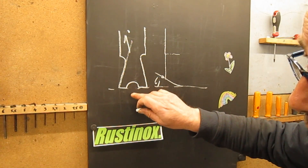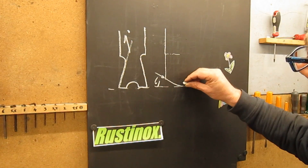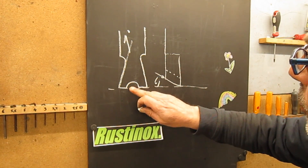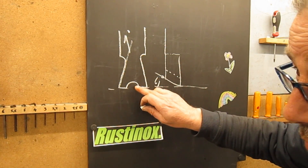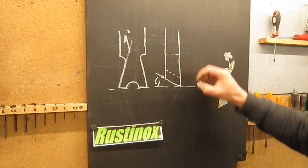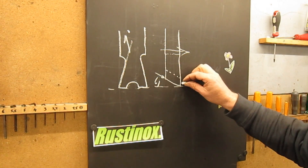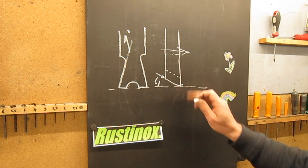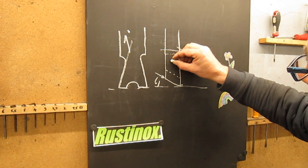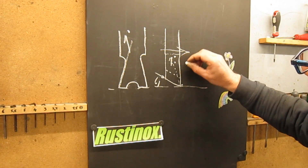You do this with the angle grinder, of course. Make sure that you have this 4-degree relief angle here — because the round or square you make is also cutting on the sides, so that's very important. Because this part was cast iron, there is no rake angle; the tool moves that way to cut and the chip is formed here. No rake angle for cast iron. For soft steel, make the same tool but with a rake angle of about 7 to 10 degrees.